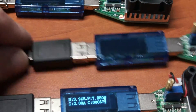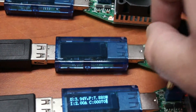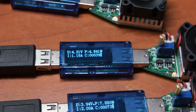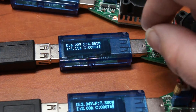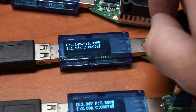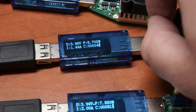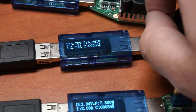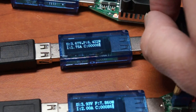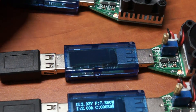Looking at the braided cable, it doesn't even come on, so I have to turn it down a lot. At 1.15 amps it's at 4.22 volts, but as I turn that up towards the 2 amps we want to measure, the voltage drops off really quickly — 4.7... 3.7... 3.6 — and the meter dies.